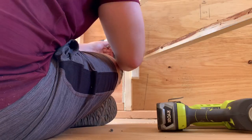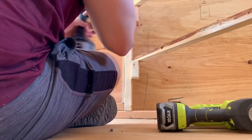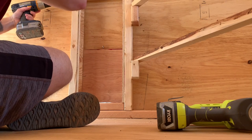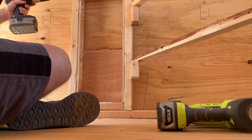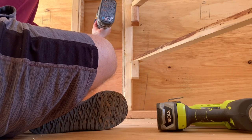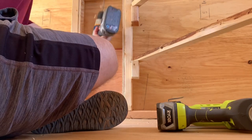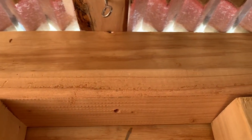We like how that's looking so we'll screw it together. These are exterior wood screws — inch, inch and a quarter, inch and a half, something like that. Each side and then we'll do the two-by-four. Once the two-by-four is secure, I'll drill a pilot hole — that's what my rope will go through. The rope I used is 5/32nds thickness. We go from there up through that hole, up through that hole. The holes are a little bigger than 5/32nds, I think they're quarter inch or so.